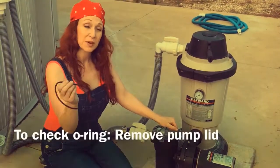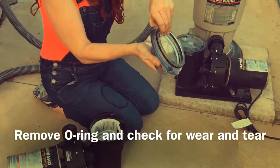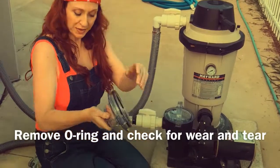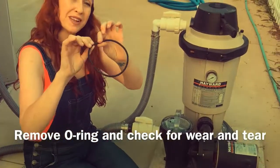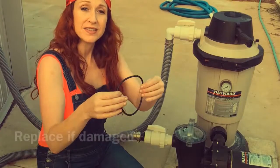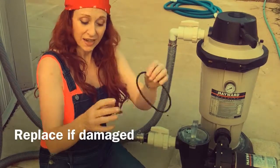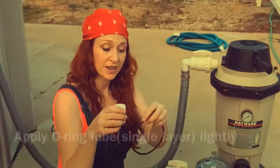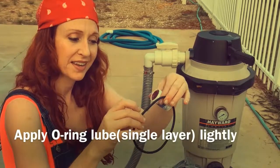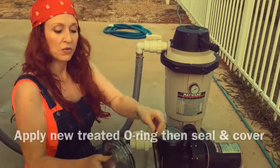The other thing to check would be your pump lid o-ring. We're going to get into the lid here — take that off. That's where you're going to find your pump lid o-ring, right here. Sometimes you have to pry it out with a little pick or something to get that o-ring out. If this o-ring is squished and flattened, or if it's misshapen too large, and it's got a lot of splits and cracks on the material itself, that's a clue that it's a bad o-ring and it needs to be replaced. When you get your proper o-ring, you then want to put a little bit of o-ring lube around the o-ring — just go all the way around and coat that o-ring, just a light layer, nothing excessive.